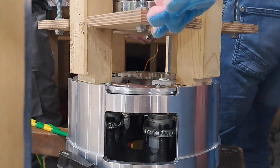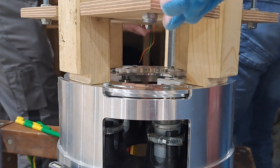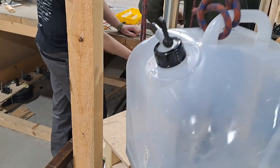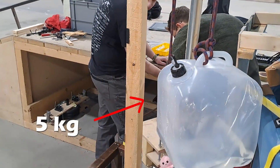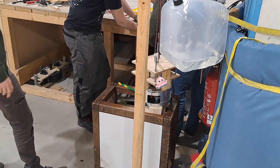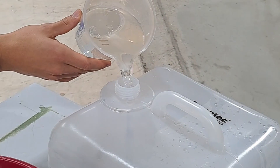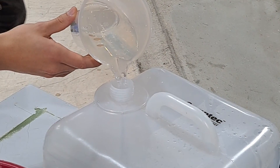In order to have proper fidelity with the Transcendence rocket, we need a five kilogram dummy mass placed on top of the separation ring — that's essentially going to be the mass of the avionics system, the parachute recovery system, and the nose cone. Of course we also had to put a five kilogram counterweight on the special stand to have that all balanced out. Our way of doing this was to basically fill up a bottle with water. This works really well because you can vary how much weight you put in — you can add a little bit of extra water to counteract friction in the system, which gives you some flexibility.